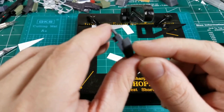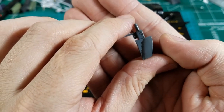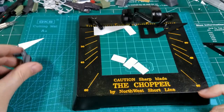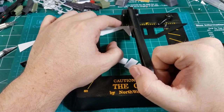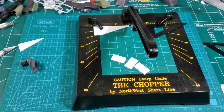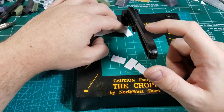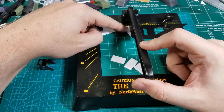Since this has the flat side right before the angle, I'll need to make sure that when I put this in here, the guide lines up, and the blade meets the part not at the corner but slightly down the side there. So I will close this — I'm just going to eyeball it. Actually, I'm going to ballpoint it. I have a mark on there now that I can kind of see. I'll eyeball this until — yeah, that's about right.